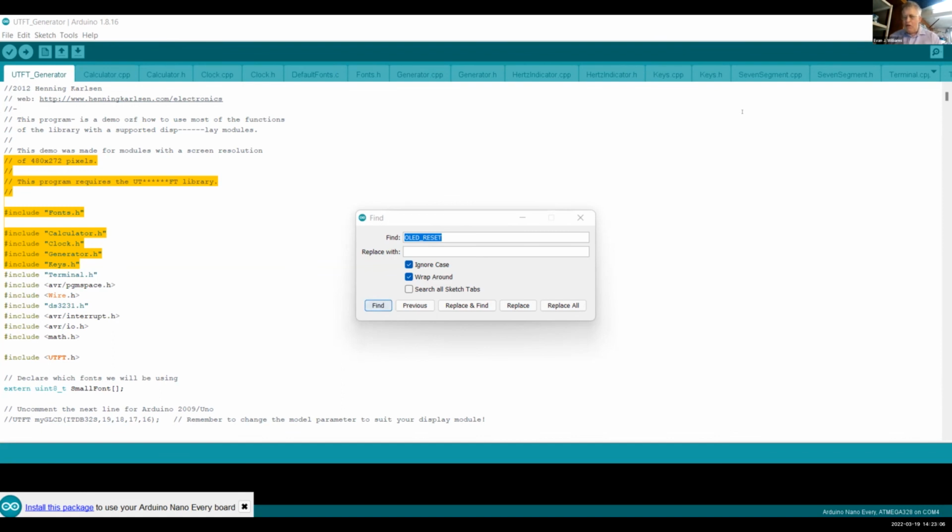There's an Uno plus Wi-Fi out there, which is a very standard form factor. It seems as if the Nano is used quite a lot now, though. For the Nano, you would have to put it on a breadboard and connect the wires. It's not as easy as with the Uno, where you just plug wires in and let it go from there. But definitely, it's a standard that is around, and so many compatible or related boards that are not Arduinos use this footprint. So it is a standard and very important.